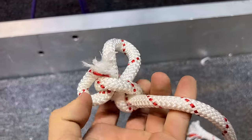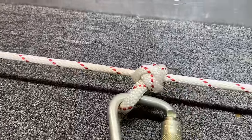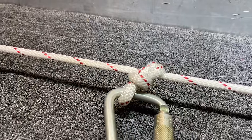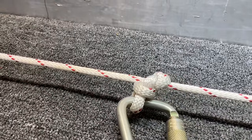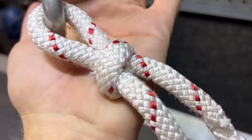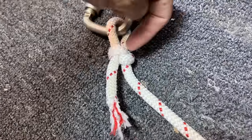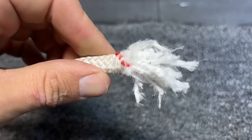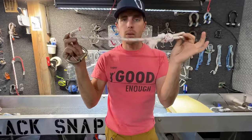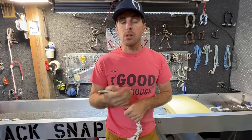It didn't slip, but it's starting to fall apart in this area. Let's try one more time with something in there. It's starting to slip now — that thing is glazed and I could see it tearing as it happened. This strand was going around and through, so having something there obviously helps. The results are a little lower than I usually get for eight-to-eight on this rope. I'm going to conclude that I'm getting lower results having an alpine butterfly in the middle when pulling end to end, whether or not something's in the loop.